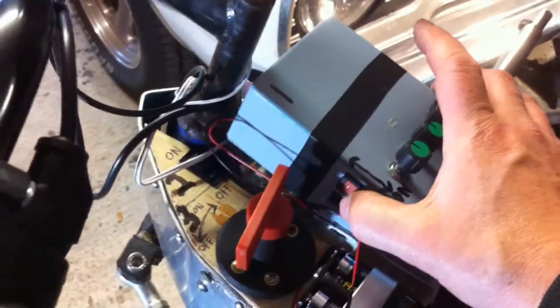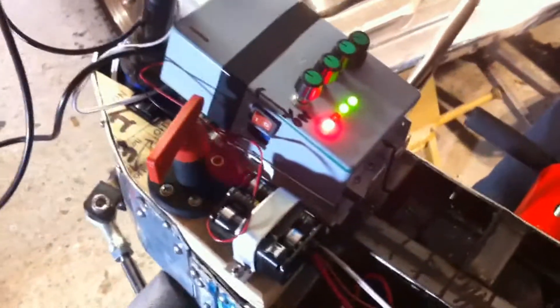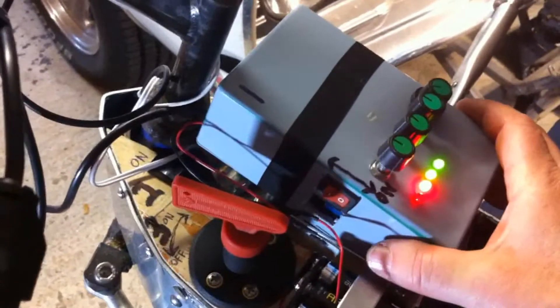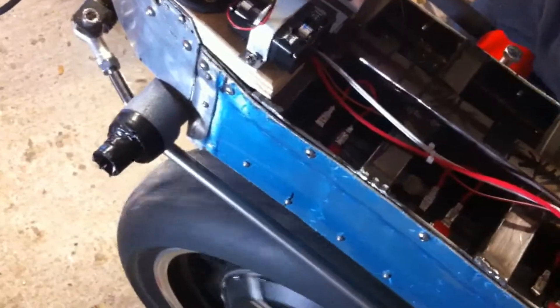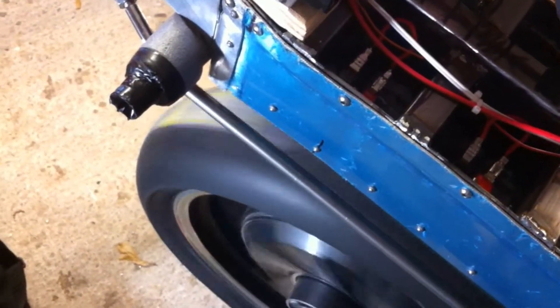We'll go back to monitor mode and do another test. We've changed the maximum motor power from 21% to 50% in the Kelly controller. We'll turn on the Arduino, press the dead man switch, turn on the brain of the Kelly controller, and turn on the main power. These two lights are lit so the Arduino is putting out two and a half volts. The second red light is now lit — it's waiting for me to bring it to level, and when it goes out it will become live. There we go — we're live. Tilt the box forward and the wheel should... oh, now see how much more vigorous it is! That's twice the speed — that's a lot more.